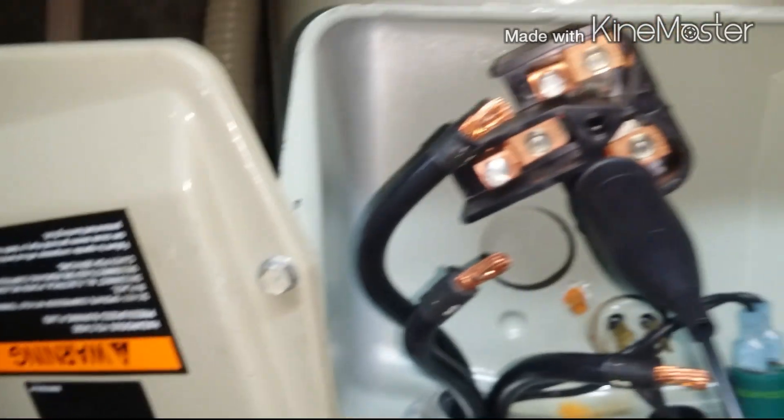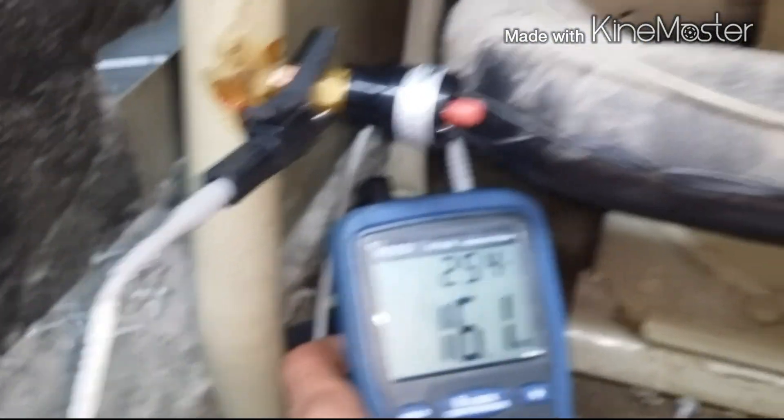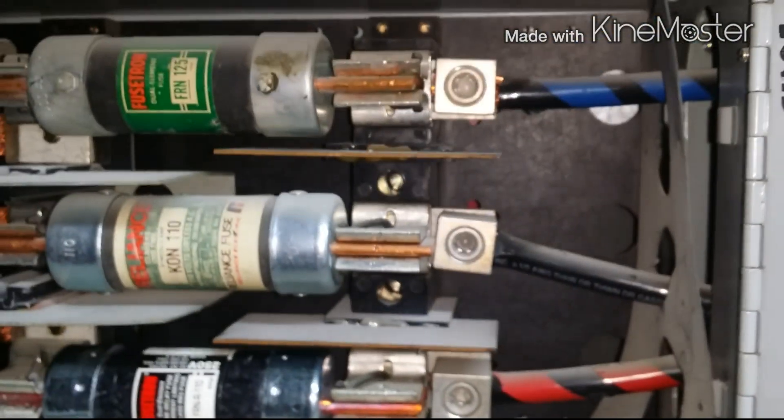So again we got 16. I'm just going to tape this up, pull the wire off the contactor, turn it on just to make sure. I did come here and checked all the wires to ground, to the conduit, to see maybe one of the wires is bad — but pretty much just went down the line, checked the contactors, checked everything.